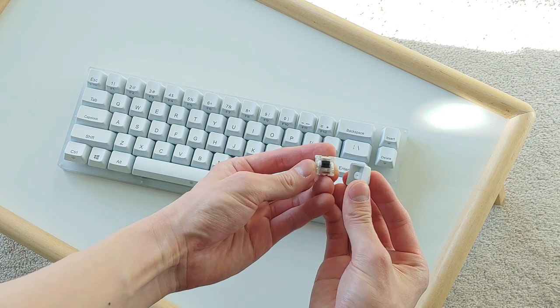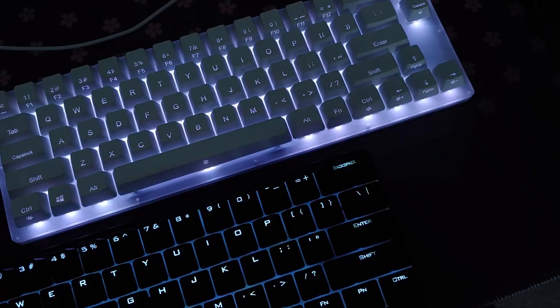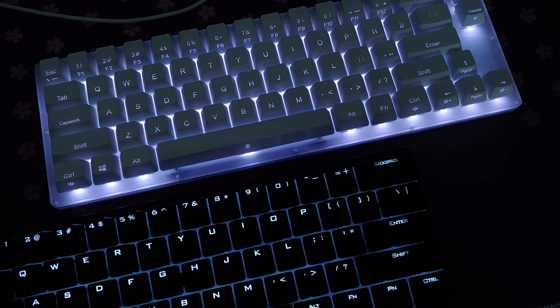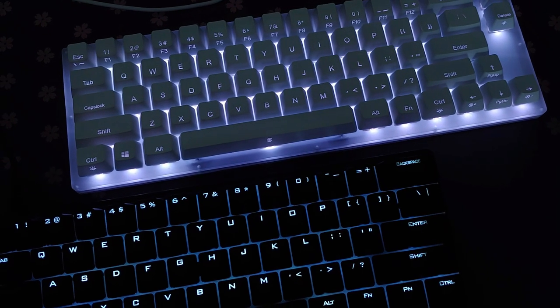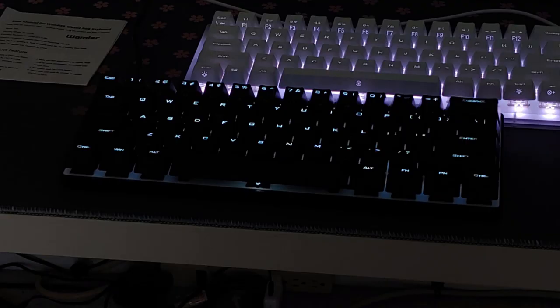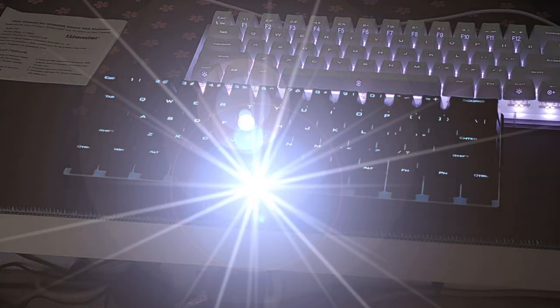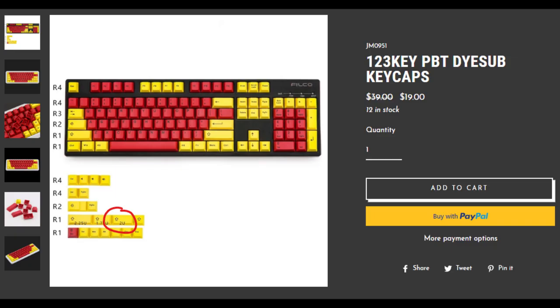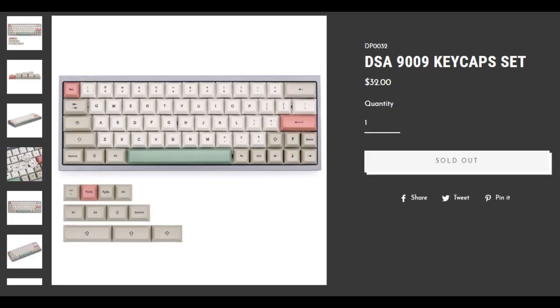The legends are on the bottom because the switches are oriented correctly with the LED facing you. Typical gaming keyboards put the legend on top and rotate the switch 180 degrees to support this, which causes compatibility issues with Cherry profile keycaps. Seeing bottom legends on the Worm, it doesn't even look bad. Back in the days of through-hole LEDs a correctly oriented switch might shine light into your eyes, but that's largely obsolete now. The layout also lets you get physical compatibility out of basic sets, and because the GK64 layout has been popular, there are a fair number of sets shipping with 2U shifts.